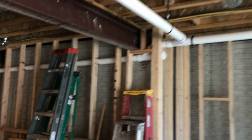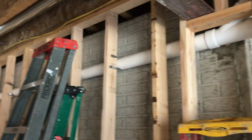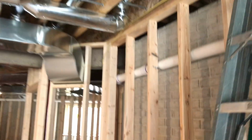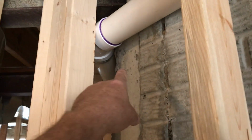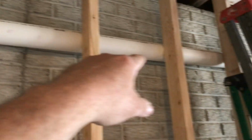And then we actually ended up getting it between the walls. There's actually like 3.5 inches, or actually more than that because there's a half-inch gap after the pipe is in there, so probably 4 inches. We had to chisel a little bit of the concrete here to get this through here. And this is all just done with banding strap here, 1/4 inch per foot.